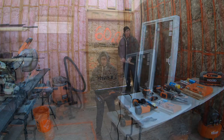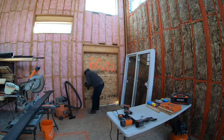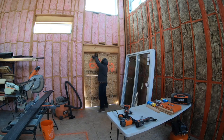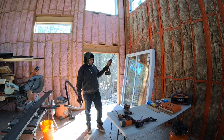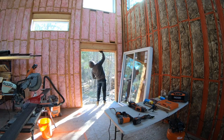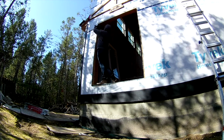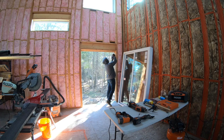First I'm going to cut out the OSB. I'm adding a 2x2 to the top of my framed opening. The door I purchased at Home Depot is 2 inches shorter than the expensive door from the window supplier. Adding the 2x2 and foaming the frame in tight will be a great solution for this problem.